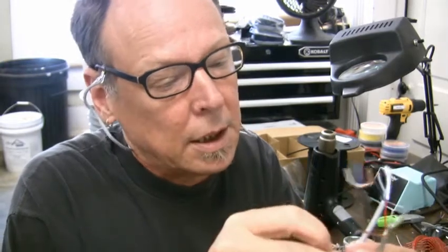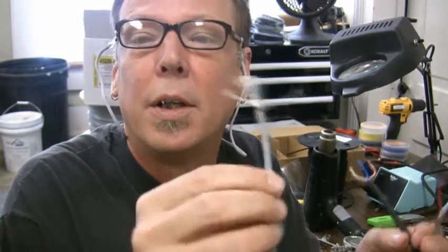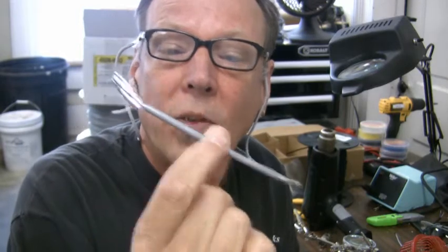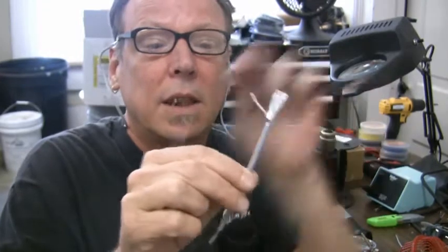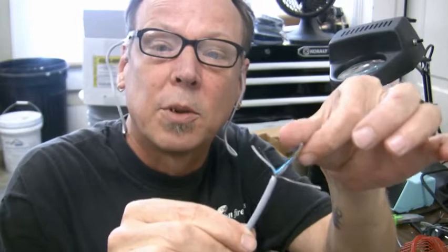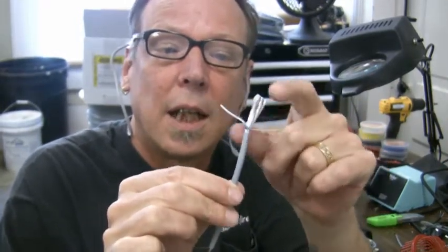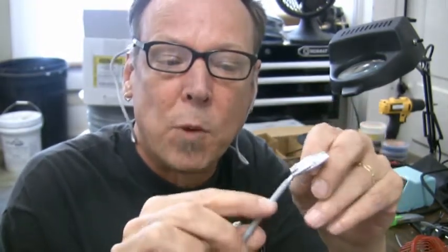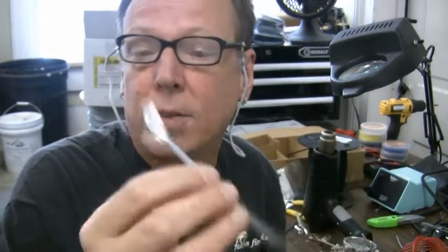This is probably the cheapest wire there is. This is commonly referred to as 291. It's pulled inside of conduits, and in the old days it was commonly used in snakes. As you can maybe see, it's hard to see, but basically you have two conductors, a foil shield that wraps around the conductors, and then a drain wire that's outside of the shield. That shield wraps around there, and it does a pretty good job of rejecting common mode noise, like RF and what have you.